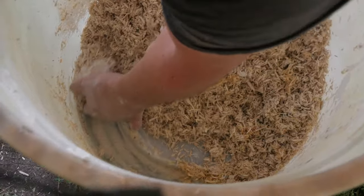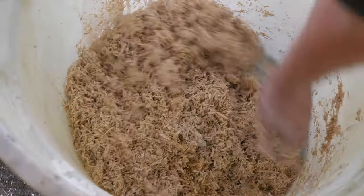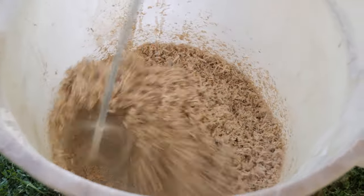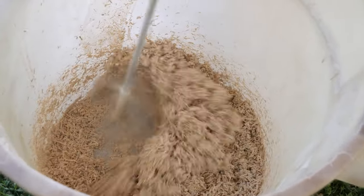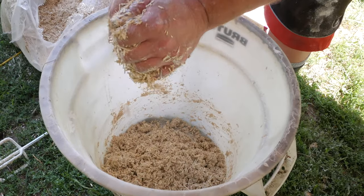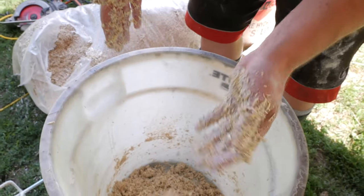There's a little groove down here holding water and lime — the bucket's not flat — so it's really important that I get these mixed around and everything gets mixed well. Once everything's been mixed thoroughly, I want to show you what the consistency should be: you should be able to make a snowball out of it. You can see it's all sticking together nicely, and that's what we're looking for.